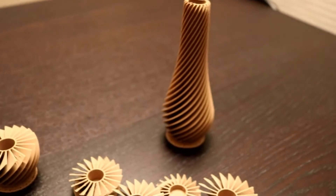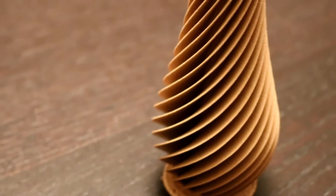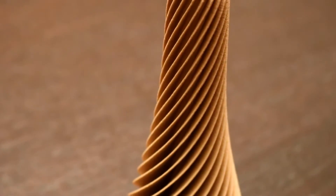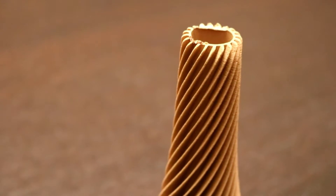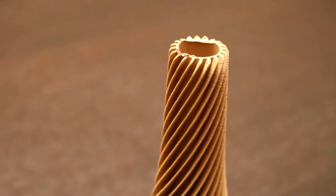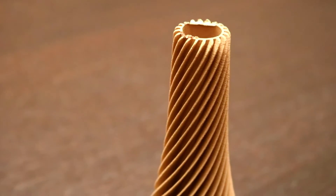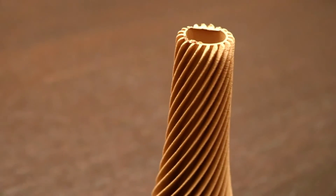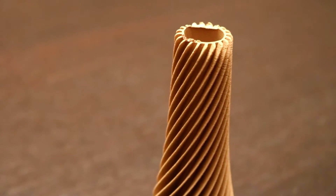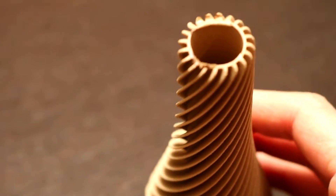After that I produced that print right there — the spiral vase — and there's really not a single thing wrong with it. Okay, the top has a bit of a problem, and that was me being greedy. In Simplify 3D it knew my print Z-axis is 150 millimeters and automatically resized it to 150, but I forgot I had thrown down a raft, so I was probably at 152 or 153 millimeters, and the print head started to mangle the very top.